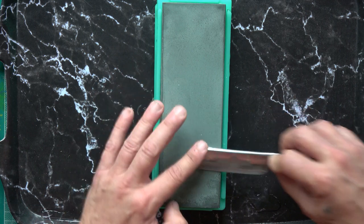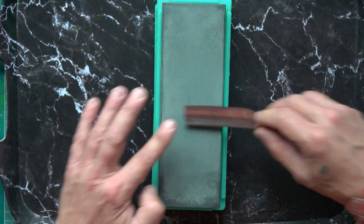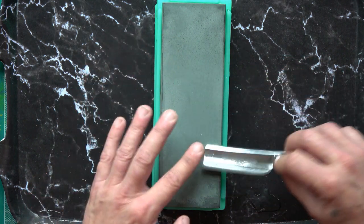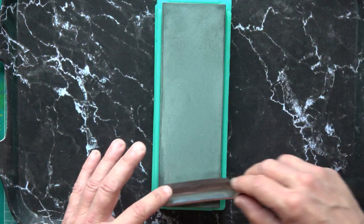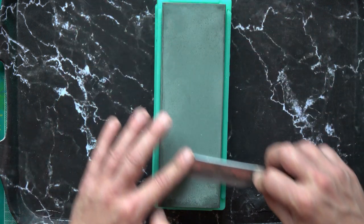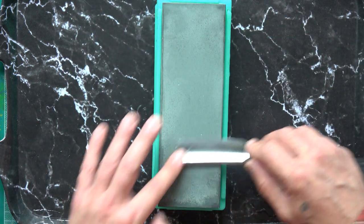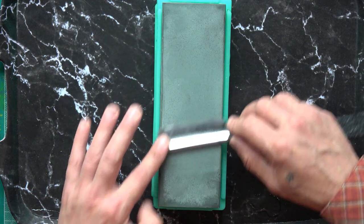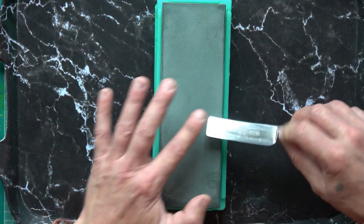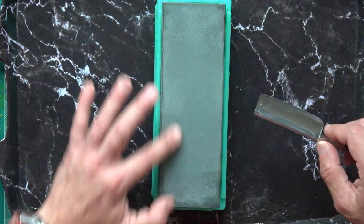Should really kind of start seeing the difference on the old polish on this stone. You can shave straight off of this stone. If you're good at stropping, you can get an edge really good off this stone with stropping, especially a bit of loaded, pasted stropping. But for a lot of people, 8,000 is plenty good enough. And I've got to admit, I've never really shaved off of it because I've got my 12, so I've always just took it to the 12. Some weird little flecks in it.